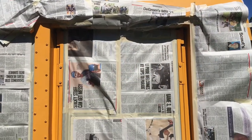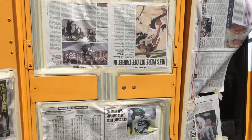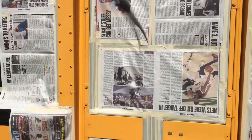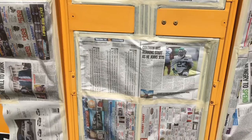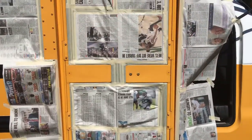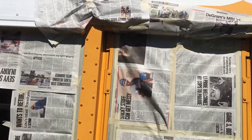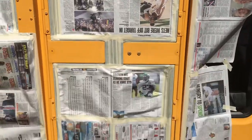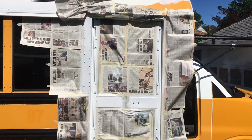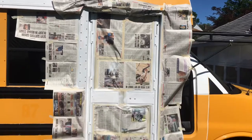I decided to do a little spray painting. Getting in these hinges with a brush or a roller would just be incredibly difficult and probably very sloppy looking. So we degreased all this, scuffed it down with a scuff pad, masked it all off, and we're going to shoot it with a spray can of white. One coat covers really well — let it set up a little bit and hit it one more time, and that should be good.